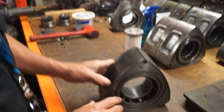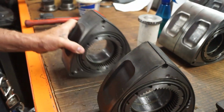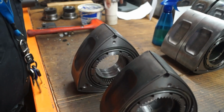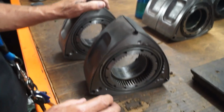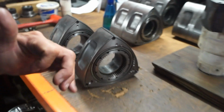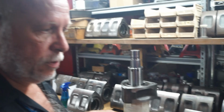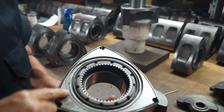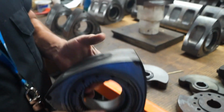This was the most difficult engine I have ever had the, not gonna say pleasure, challenge, yeah, the challenge to balance. For starters, RX8 rotors are the only series of rotors that came from the factory out of balance. Totally out of balance. Here's one, no corrections of any kind on these rotors. This is an RX8 rotor.